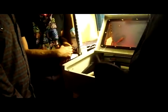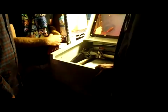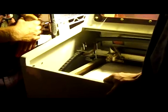Another recommendation for printing, when you use this laser, is to try to keep everything on the grid. With the grid, it will help you to leave a margin from starting from the left. You want to try to leave an inch margin on both sides so the laser will not run into the side wall. If you're printing at a higher speed, there's a higher chance of failure, and what will happen is it will skip, print over to the left where it originally printed, and start banging into the wall continuously. We don't have the highest quality printer, but we do have a laser printer, which is awesome.